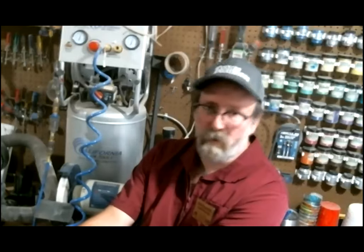So please, please, please understand what the blow-off valve is there for, and that is so it opens up and lets the pressure out when something distracted you and you walked away, and the air compressor is still filling it up with air. Please, the blow-off valve, if you're going to build one. That's all. Absolutely. And never, ever exceed the pressure that's rated for that pot. And if you don't know, if you don't trust it, 40 pounds. That's all you need. Just stay with that. Play safe. We want to have you back tomorrow.